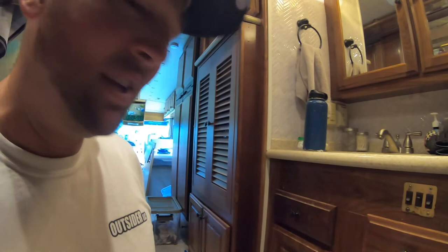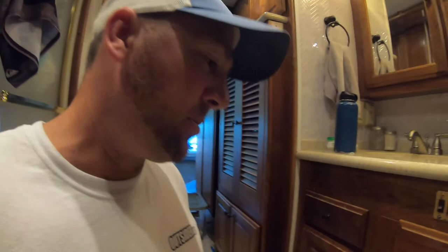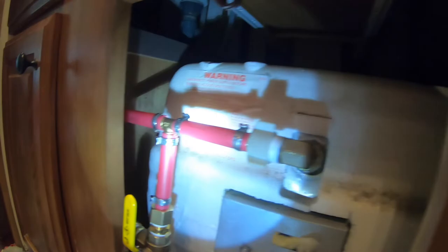I'm going to be watching this every few minutes. I'll look in here and look for any signs of water dripping. And after a few hours of no drips, and then every few hours for the next few days, I'll look in there to ensure that there's no new leaks. Typically, within the first few minutes or half hour, you're going to see some water leaking. The system's pressurized, so right now we should see leaks in the next few minutes if there are any. So we'll see what happens here.